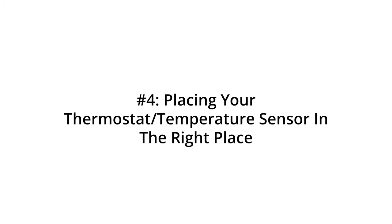Finally, you'll want to make sure you're putting your thermostat in the best place — or more precisely, whatever is measuring the temperature of your room. If your thermostat is right next to the panel, it's going to think your room is way warmer than it actually is and switch the panel off before you even get a chance to get warm. It's best to place your thermostat somewhere that best represents where you're going to be. If the sensor is in your thermostat, place it on the wall opposite the heater in the middle of the room. If your temperature sensor is on a remote — like in our Next Gen or Nexus Wi-Fi ranges — keep it on a sofa or coffee table near you.